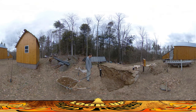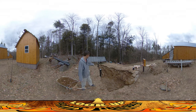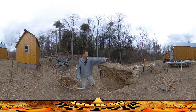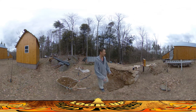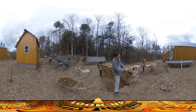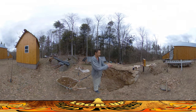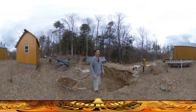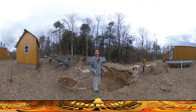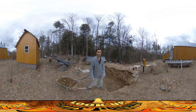It will provide a little extra shielding on the inside but mostly it's a structural thing — I don't want a lot of yank on these light tubes. Things are going really well. I was able to get that thing in just in time — the last five minutes of mixing concrete yesterday it started to rain and hail, but I got the concrete in there and topped it off with some dirt so rainwater wouldn't get in. It's just curing down there. I'm going to leave all the scaffold on for a couple of days since concrete takes at least that long to set up hard, and if I can let it sit for a week it'll be that much stronger.